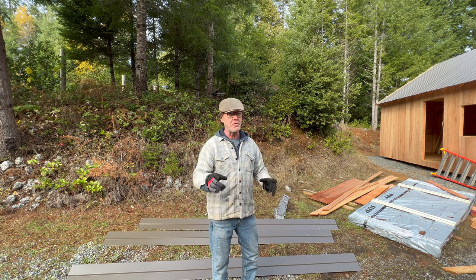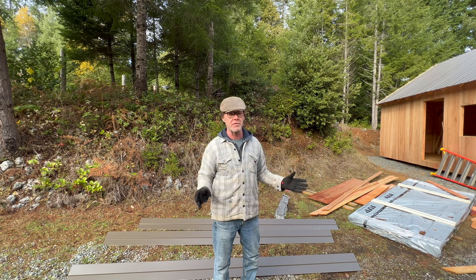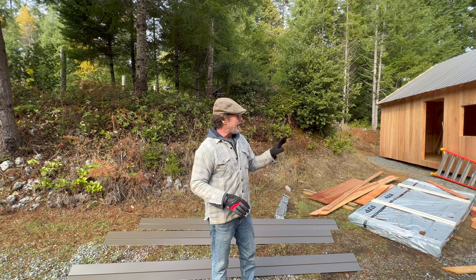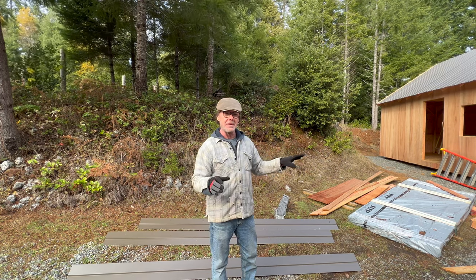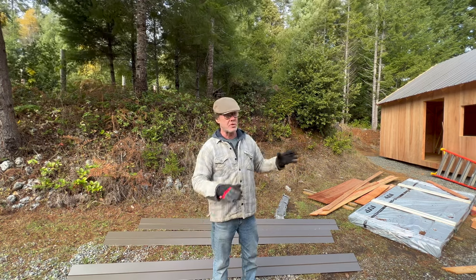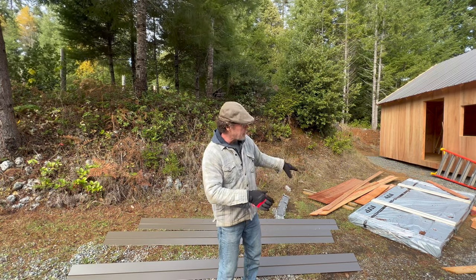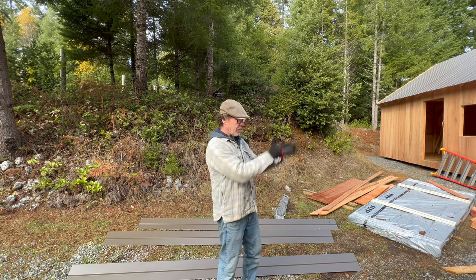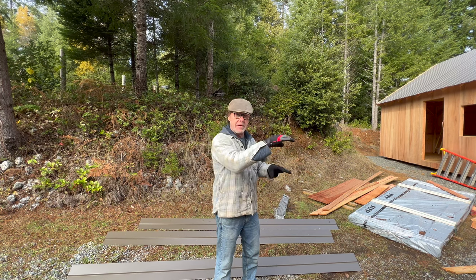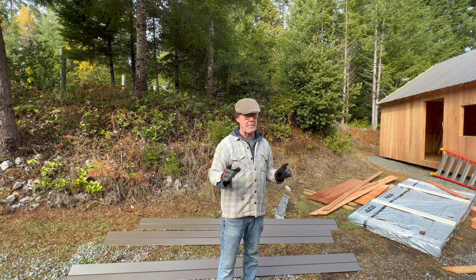I did a little research on YouTube and looked at some videos from everybody from professional roofers to the do-it-yourselfer. And honestly, there's no easy way to do this. But I did see some ingenious and creative ideas, both from the pros and the do-it-yourselfers, which I may try. One is using an extension ladder to lay on the pitch of the roof with some padding on that ladder. The bottom of the ladder actually sits in the bucket of my tractor, so I can raise that bucket to whatever level I want, stabilize the tractor, and then you climb up the ladder laying against the pitch and do your work from that angle. That seems like it might be pretty reasonable, and I may end up doing it that way.